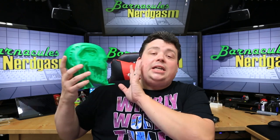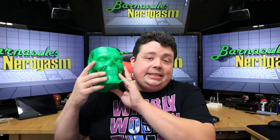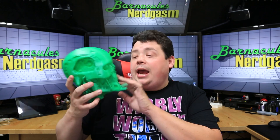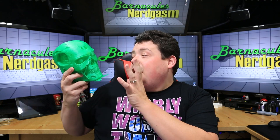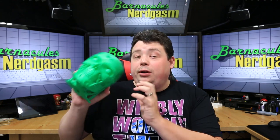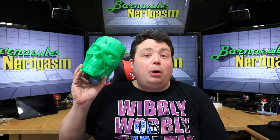But I've wanted to print this guy for a long time, and I printed him in a new material called ColorFab XT. Now, this is a beta material. This is the translucent green. And it's phenomenal material because it has such a high melting point. I actually printed this at 260°C. And it really makes for a very, very strong, durable material, even when it's printed very thin with no infill like this is. All right, well, let's go ahead and get this party started.